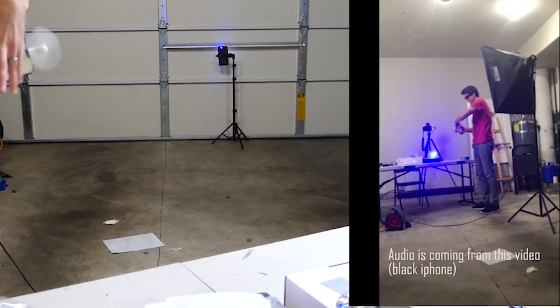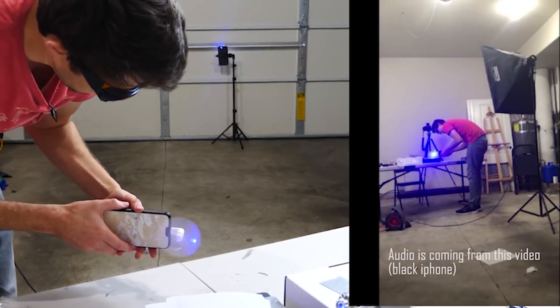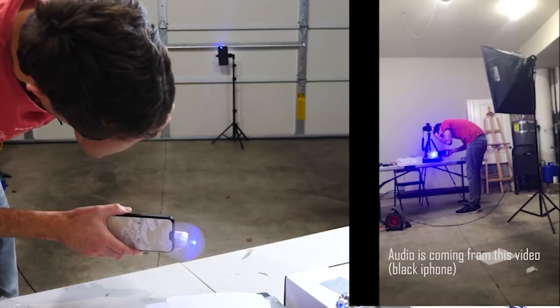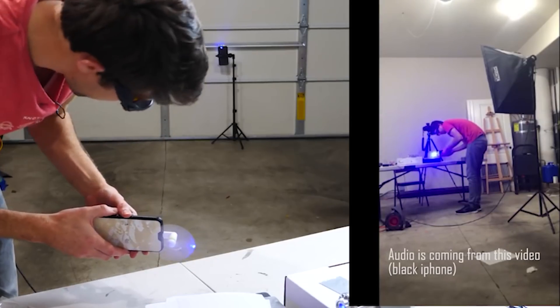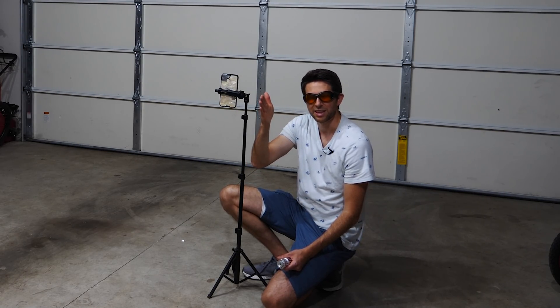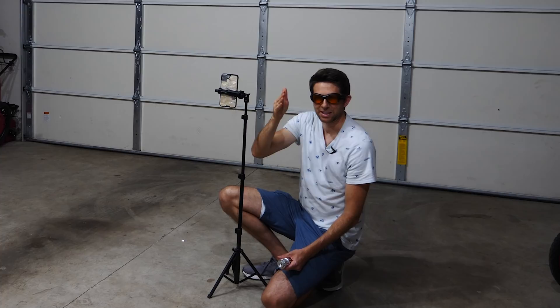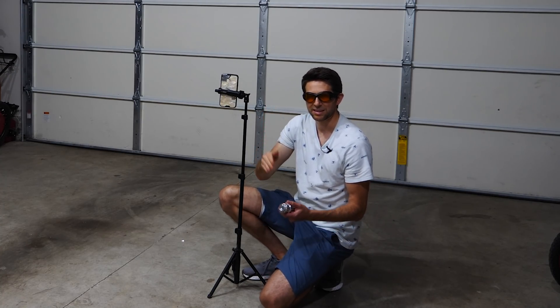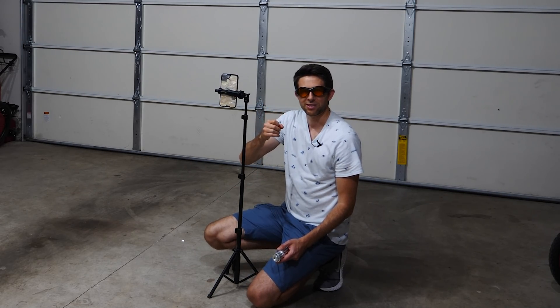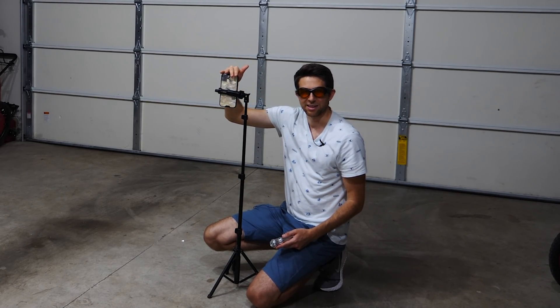So I'll turn on my fan — you can't hear it but it's spinning right now. When I put it in front of the laser light, they're not exactly sure why this happens. It could be due to the heating up of the internal components of the microphone, or it could just heat the air inside and push the diaphragm of the microphone, and when it gets unheated it relaxes. So when you pulse the laser it could make the diaphragm vibrate back and forth as if it were sound. Basically by pulsing a laser on a microphone you can get sound to show up on the microphone.